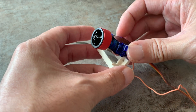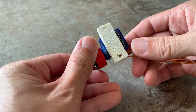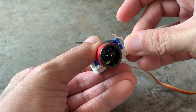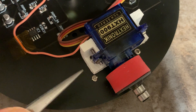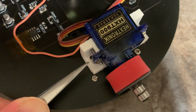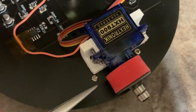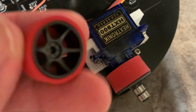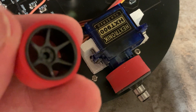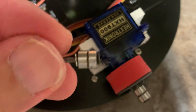I'm using a 9g servo that's modified to turn 360 degrees, and I've printed a 3D mount for it as well. After the servo is secured to the 3D printed mount, the whole attachment is installed to the tracker board using two long screws and nuts. There's a slot in the 3D printed mount to allow fine adjustment of the servo's position. I'm using a Mini 4WD low profile wheel with a diameter of 21mm, which gets secured to the servo's horn using a long screw with bearings.